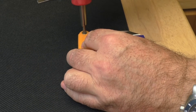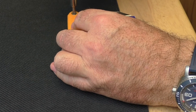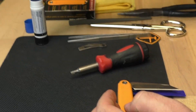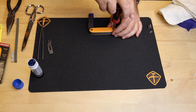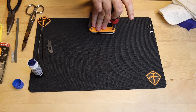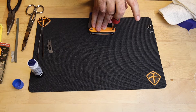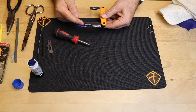Put this on here without scratching everything up — don't be ham-fisted. Go until you feel it like you hit a wall: it'll be getting snug, snug, snug, and then it just goes boom and doesn't want to go anymore. You could go more, and you will break it — don't go more. Take our second screw, put some blue Loctite on there, drop it down in. Now this one is a little proud, so when I go to tighten it I can feel it sucking up from the bottom. You'll feel it — it's stiff but still going — and then you feel it hit the wall. When it hits the wall, you know you're not going to get great action out of the knife.